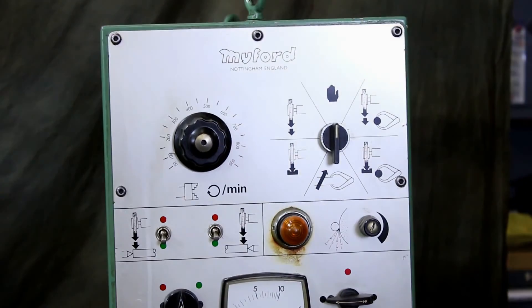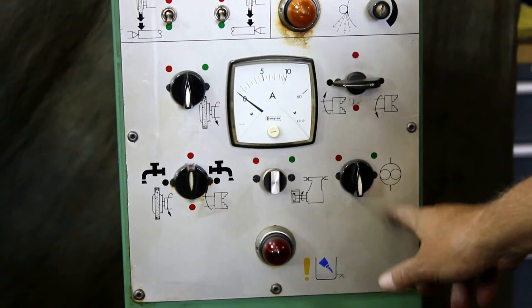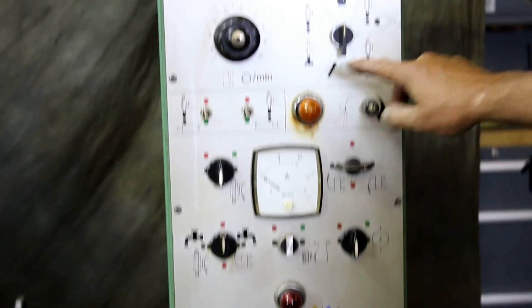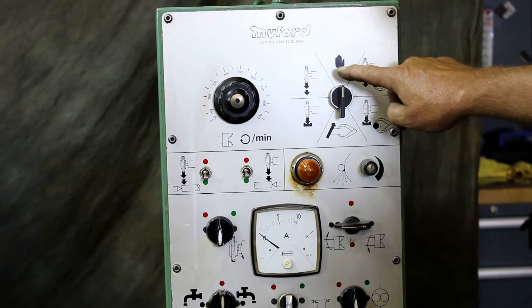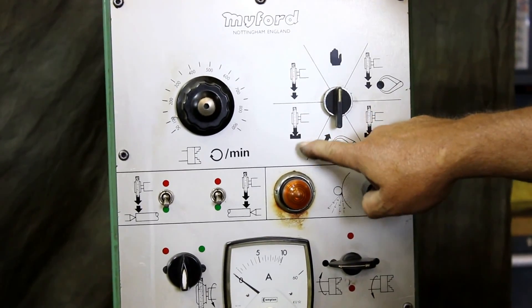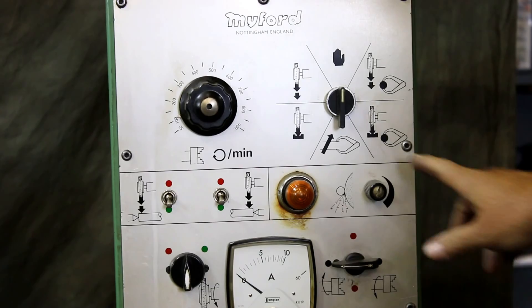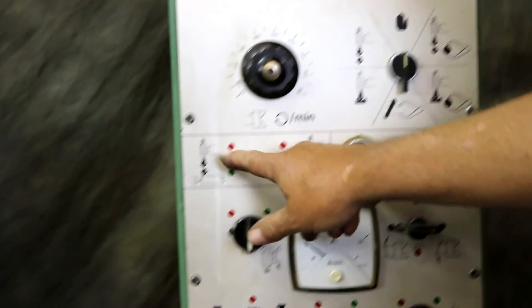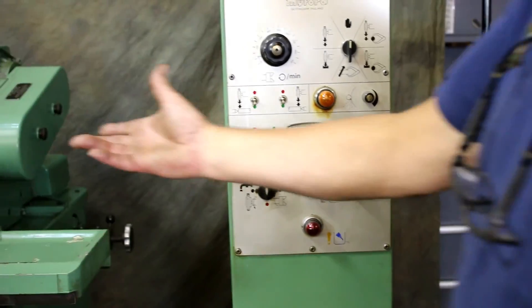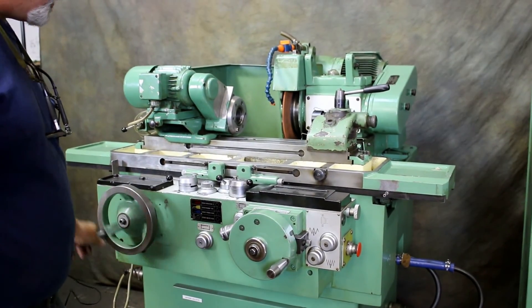This is currently wired for 440 volts. You have controls on the panel here — this is to start the hydraulics, the spindle headstock rotation, and different modes of grinding. You have manual mode, traverse mode, incremental at each reversal, and plunge grind straight in. There are also various programs using a Marposs-type in-process gauge, which we are not equipped with, a spark-out timer, and a selection of infeed of the wheel on the left, right, or both sides, and when your coolant comes on.